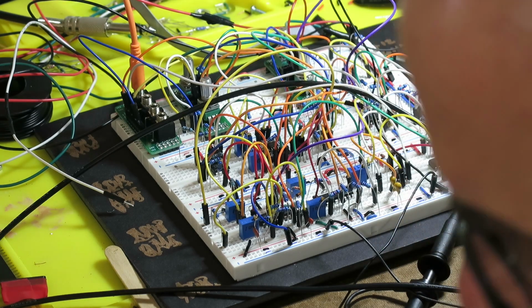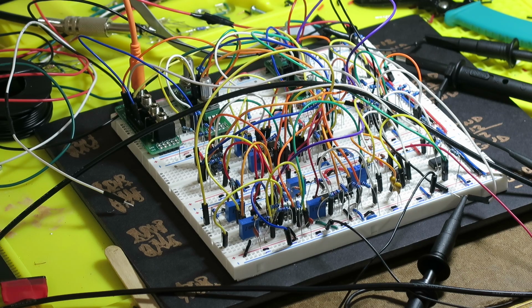So that is good. Then I took a closer look at the falling edge of the core ramp output, and it looks different with the different JFETs. So the falling time varies, the amount of time it takes to get from the top to the bottom, which is kind of what I was looking for. It's kind of what I expected might be different from one JFET to another. But also the voltage that it falls to changes, which I wasn't expecting. So the two most extreme were the J113 and the 2N5458. The J112 looked almost identical to the J113. The 2N5457 looks similar to the 2N5458. It's not quite as extreme. J111's kind of in the middle.